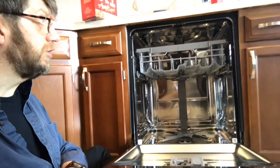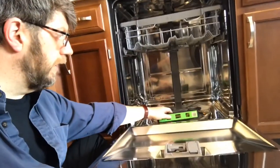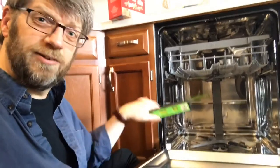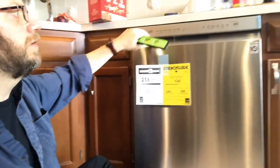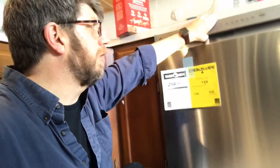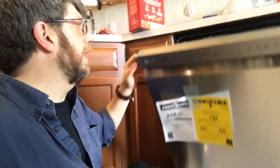When checking the feet and raising the dishwasher, we should really check how level it really is. A couple ways: you can take out the bottom rack and use a level, just put it on the ground and test it. Mine's a little bit off right now, but my actual kitchen is actually a tiny bit slanted - just the way the floors have settled over the years. Another way to check for level is to make sure that the gap at the top countertop is pretty even all the way across. If it's not, it'll be noticeable and it'll look like an amateur job. You want to have a little bit of a gap because you don't want your door to actually be scraping your countertop.